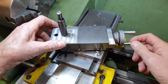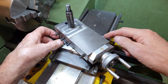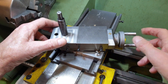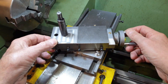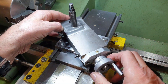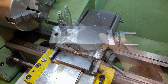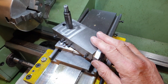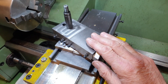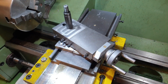For the closing shots we can see the new bracket fitted — four bolts, one in each corner, passing down through fixed T-nuts in the T-slots on the table. That feels much nicer than the previous arrangement, though of course the proof is in the pudding when it's all clamped down and I actually do some turning. All in all, a nice little modification to the lathe. I tend not to use the compound slide — I prefer the fixed tool post — but hopefully now I should get some better results with this going forwards. Thank you for watching.